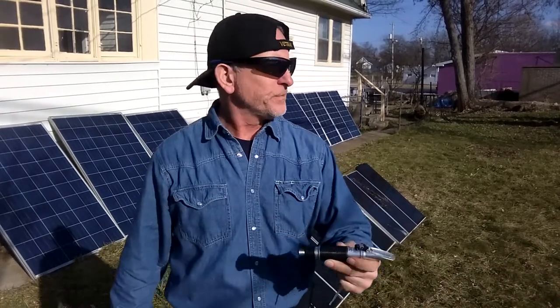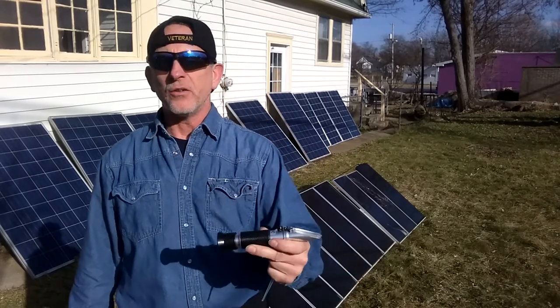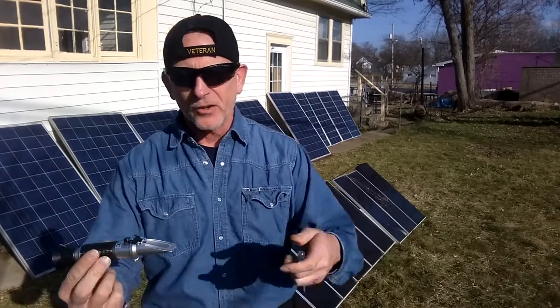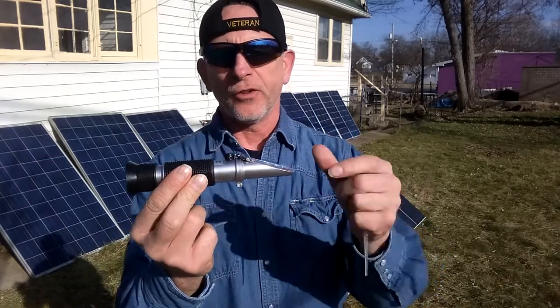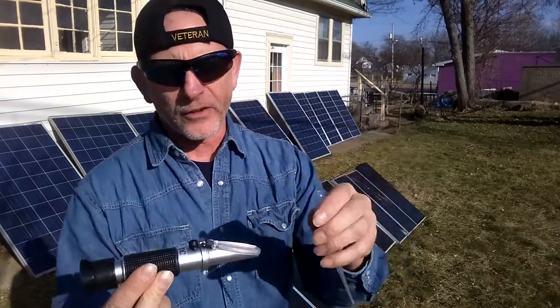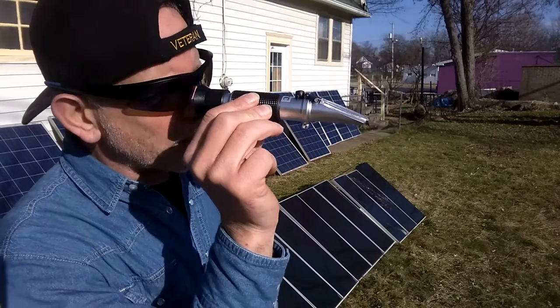Welcome to DIY SolarWinds. I'm going to be discussing shoutout number 11 to my great subscribers, and a refractometer so that you can take some fluid out of your batteries, put a drop in there, close it, look through the sight glass — it's supposed to give you a number reading. With that number, you're supposed to log it every three months so you know when your batteries are starting to go downhill through the years.